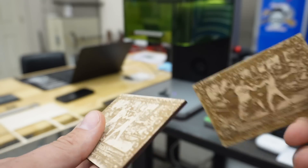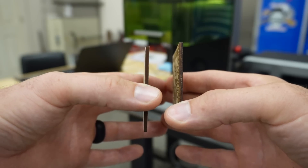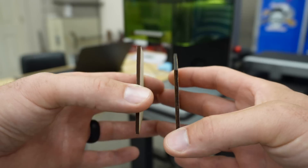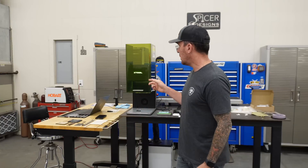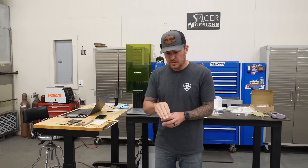When it cut, the one from the F1 Ultra actually has a slight bevel on it all the way around, whereas the S1 is a nice 90-degree cut. The reason for that is the F1 Ultra — or most fiber lasers — they don't have an X and Y axis moving back and forth. They have a central location in the lens. It doesn't give you a fisheye effect when engraving, you don't notice it, but when cutting you may see that slight angle or bevel in the cut.